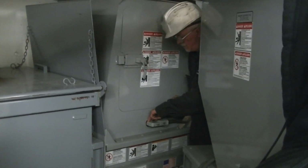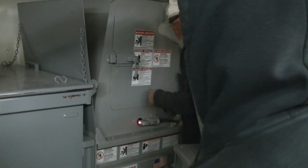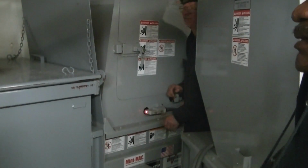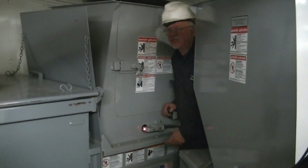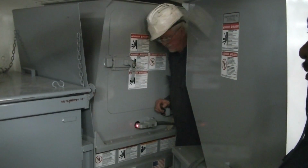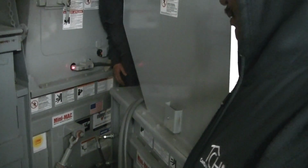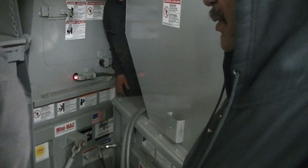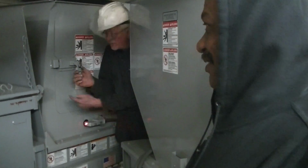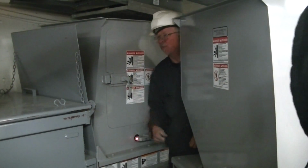It's important to keep the little lenses on the eye clean. It's got two little lenses, and on the other side there's a bicycle reflector. If this doesn't want to stay on for you, you probably have to clean it like once a month or something. Take some kind of glass cleaner, put it on a rag, and wipe along here and the other side. You can see here, it's just a little white bicycle reflector on the other side. You can open this door and reach through to it, spray something on, and just wipe it with a rag and your thumb or something.